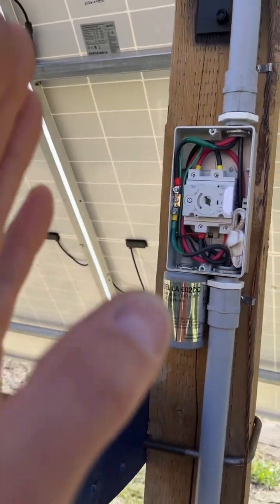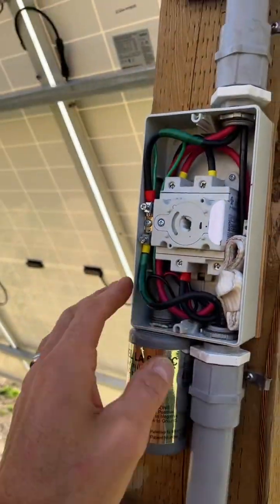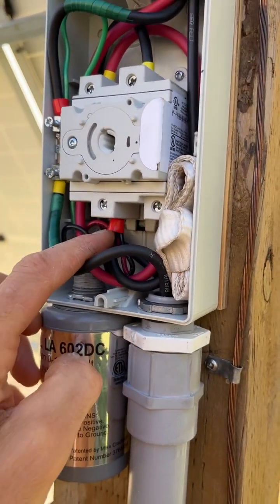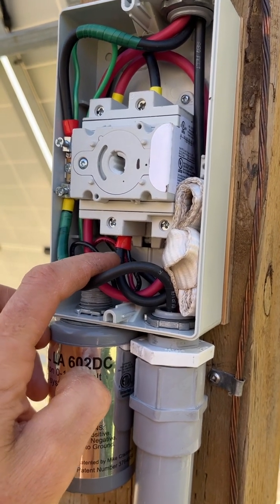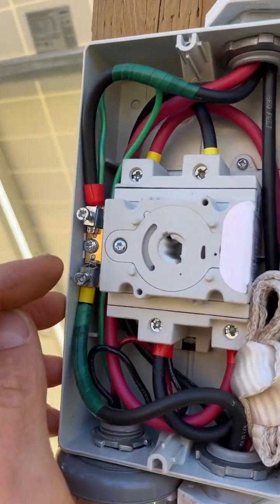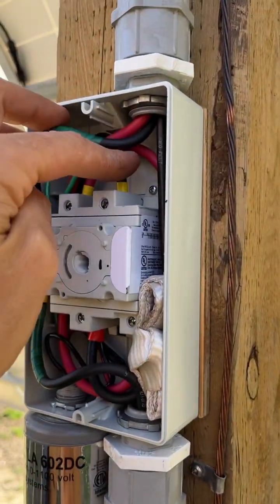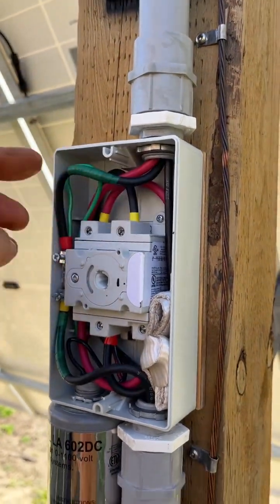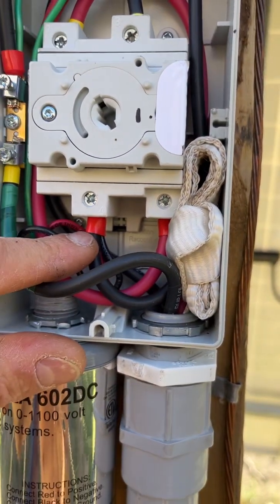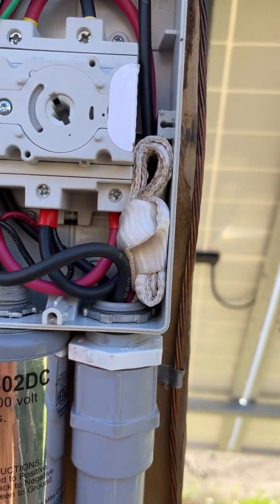Each one of the arrays already has lightning protection — it's a lot to wire in. Recap: tensioning on these is great. Using a ferrule — I used a number 7 ferrule — I joined the 10-gauge and the solid copper in there, crimped it on, got it up in the hole, and then squished down the ferrule tip so everything is secure. This is a number 10 ferrule in yellow. We did a tug test on the ferrule attachments — it's not going anywhere, holds real nice.